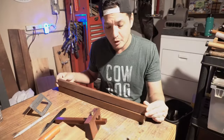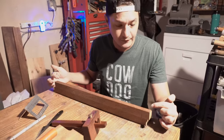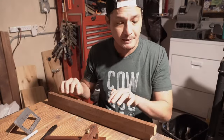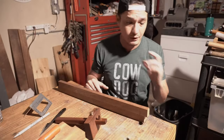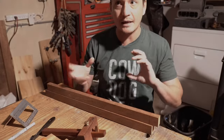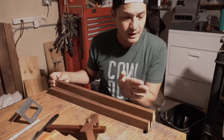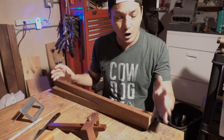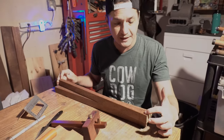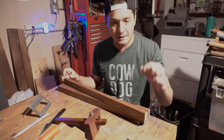I've got two reference faces marked with a circle. By doing that, I'm measuring all of my joinery off of my reference faces — kind of in the same way that I strike all my lines. I want to make sure that all my markings are based off of my best two faces. It doesn't necessarily have to be perfectly square, but they just have to be the best two adjacent sides. Anything that is not square or not flat is not really at issue here; I'm using this face to measure off of. All my components will be exactly where I want them because I am measuring off of the reference faces and creating a perfectly square tenon that is going to fit inside a perfect mortise as well.